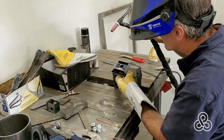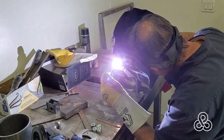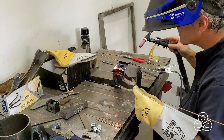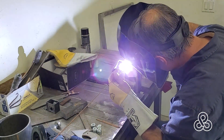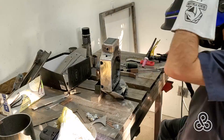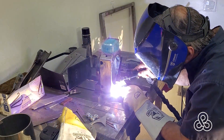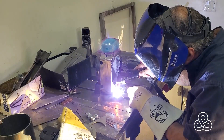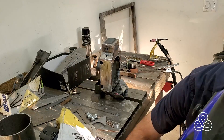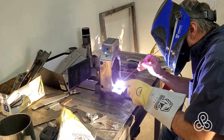So it's time to weld in our ball joint fitting. We'll run some beads across the top and get it welded tight. You'll also see a little gap up there that needs another piece welded in, but we don't have that one yet — that'll come later. We're going to get a good weld across the top and across the bottom, and that will hold this thing. It will be totally enclosed within the box section. The next video will show you the full closure of this area that holds that ball joint.